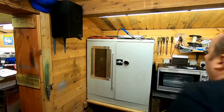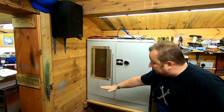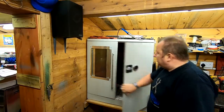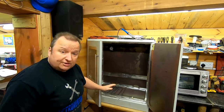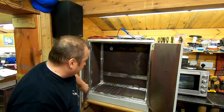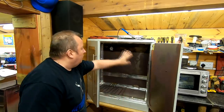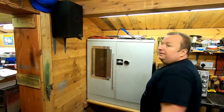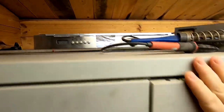Now that's the easy part — buying that. I then decided to build this powder coating oven. As you can see, it's a half-height unit, probably up to about there when it stands on the floor. This was an office cabinet, not necessarily a filing cabinet, and all I basically did was line it. I've got a series of videos on this. I put two elements in there — I had a spare cooker sourced off Facebook for about £15, stripped it down, took the elements out, put them in the base, and lined the whole thing with extra metal and insulation. This has been working absolutely fine as a powder coating cabinet. The controls are fitted to the top — all I have to do is set the timer, turn the thing on, and everything's protected. It all works A-OK.